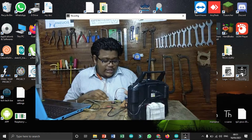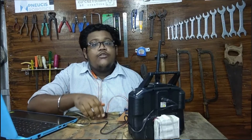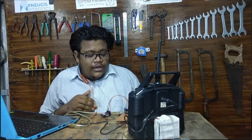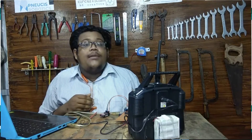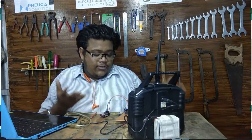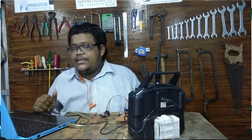My receiver is connected to an Arduino Mega — you can use any microcontroller. I am supplying it from the Mega's 5 volt and ground pins. The six channels of the receiver are connected to six digital pins of the Arduino Mega. You can get the circuit diagram from the description as usual — the circuit is very easy to make.